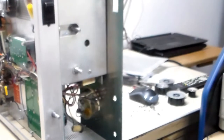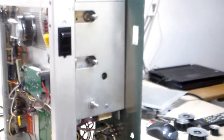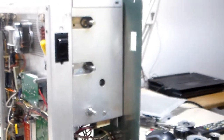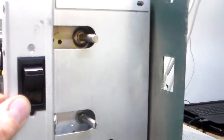As you can imagine, I don't think you'll find these switches new anymore. There's a couple on eBay for a decent price, and if you are really concerned with keeping your SB200 all original, then that'd be the way to go. Looking around, I found a switch that was rated at 20 amps AC and 125 volts, and it looked like a pretty good replacement. But when I first got this switch, as you can see, it looked a lot bigger, and that was my concern. When you look at this hole — which is actually the front plate — you'll see that it is actually smaller than the hole that's stamped in the frame. This switch here was almost a perfect fit.